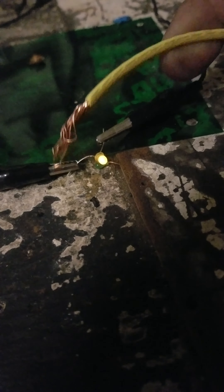Here's the first wire off of the inductor array. I'm going to touch it to the positive side — you can see it gets a lot brighter there. I touch it to the negative side and it only gets half as bright. That's positive, that's negative — it's a little bit brighter on the positive side. Now here's one of the ground rods. It cuts the negative side — you see it gets brighter than the inductor did on the negative, and it's really bright on the positive side. I don't see any arc here or nothing. I only read about three or four volts when I cross there with the meter.